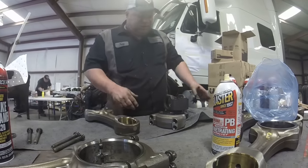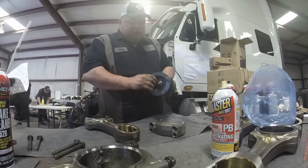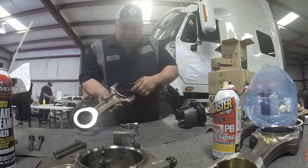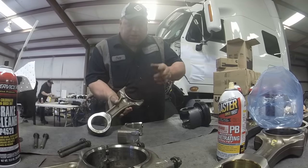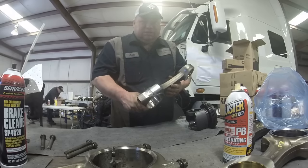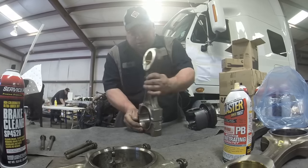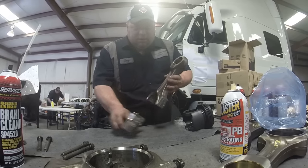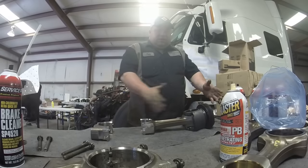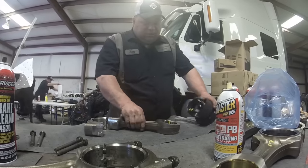Installing the retainer ring — this is a snap ring. I always put it on one side with the area pointing forward. That way I know the snap ring is always at the front of the piston. So when we set up the piston and the rod, as we talked yesterday, the tab side went to the driver side, and the number side corresponding with the rod goes to the passenger side or the exhaust side. So if this is the engine, this is the passenger side, so this will be the front of the rod. On this rod, 'Brazil' is on the front, so I'll always lay Brazil down with my snap ring down, assemble the piston like that as a complete unit with everything oriented to the front. That keeps you from getting any confusion.